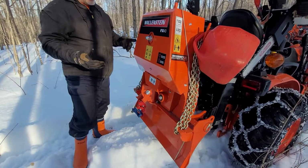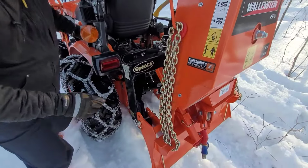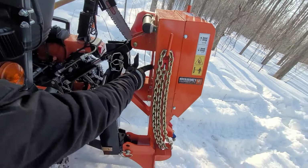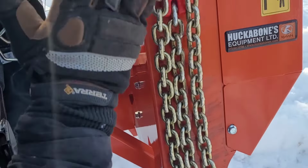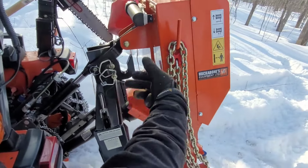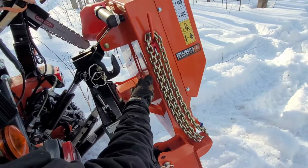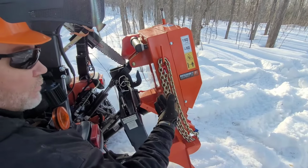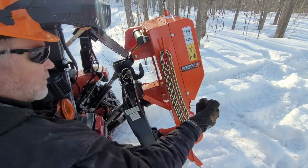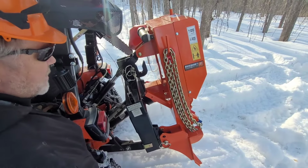And also, when I had that apart, if you come around here, it's very deep here, there's the brake mechanism for lock and unlock. This rod goes through, and there's a lever that hits against a notched cog on the drum of your winch. A set screw holds the little lever in place, and the set screw backed off on me and it just went floppy after a little bit of vibration. So it was no big deal. If anybody has that issue, I would probably put some blue Loctite on it. I did tighten it up back in the bush here. I didn't have any blue Loctite, but when I get out and get some supplies, I'll put some blue Loctite on that so it doesn't come loose again. But other than that, it's been working flawlessly.